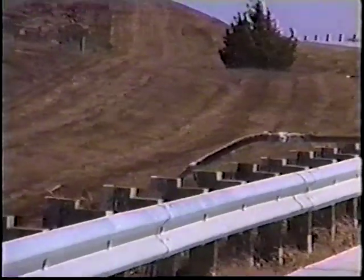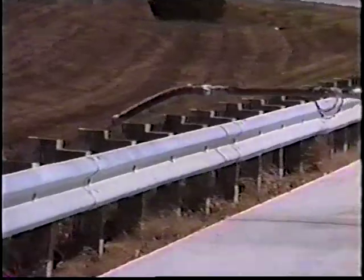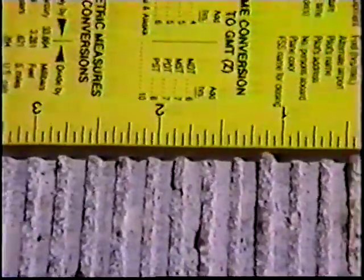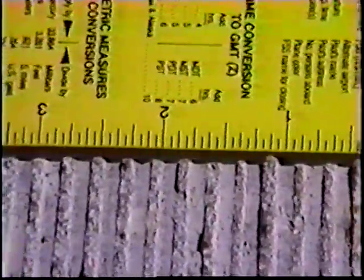The slurry residue, water, and grinding material generated by the machines was simply pumped over to the side of the road and dumped on the shoulder. The texture left by the grinding operation is longitudinal grooving. The series of diamond blades used in the grinding are approximately an eighth of an inch wide each, with approximately an eighth of an inch spacer between each blade. On this close-up you can see the longitudinal grooving left by the diamond grinding operation.